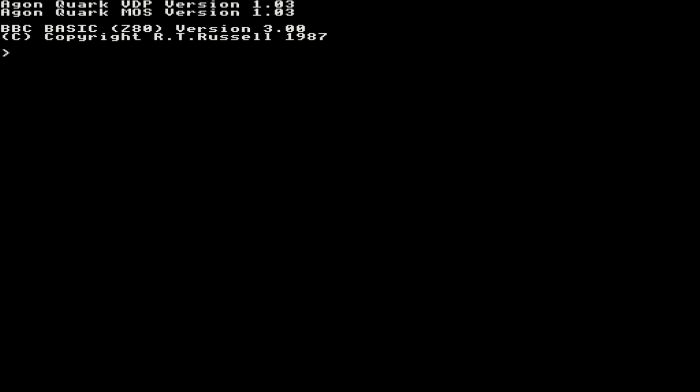So the board doesn't come with any firmware, you have to download it from a site, for which I'll put a link in the description section of the video underneath. So currently we're in the BBC Basic, but to get to the operating system MOS commands, you do it by typing in the operating system star, which means you're going to invoke an MOS command. You wouldn't have that problem because it's not installed for you yet if you got a new one. But I actually put the commands to load up BBC Basic in something called autoexec.txt, and that is like a batch file that you'd see in DOS, for example. MS-DOS, if anyone remembers that so long ago. And that just executes a series of commands really. It's just a regular startup batch file basically.